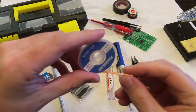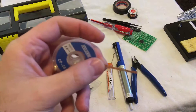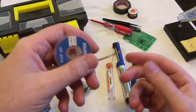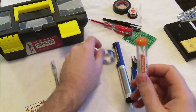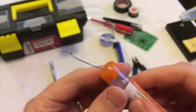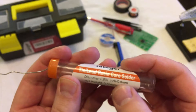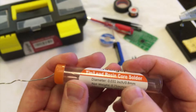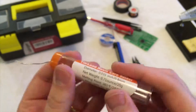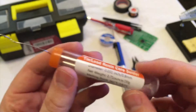The wick is not coated in rosin, so you might think it doesn't work. You actually have to coat it in rosin — you can use the rosin here, just rub it on and the wick will do what it needs to do. The solder itself is not bad. It'd be nicer if they gave 0.4mm solder, but for through-hole soldering it's thin enough — and where it is thin, tips and tricks can still get the job done.